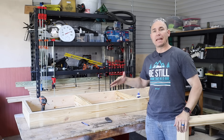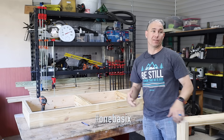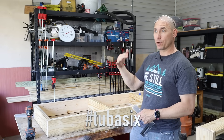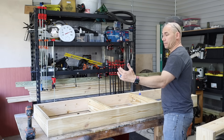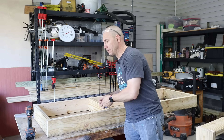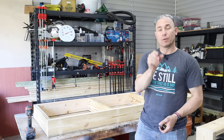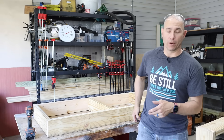So we've got both frames built. Now we're going to put some decking on there. I'm just going to use one by sixes because they're lighter weight and they're a little less expensive than a two by six right now — trying to keep this as low cost as possible. I'm going to cut four one by sixes to the length of this frame, which is 77 inches. Cut four of those and we'll put a gap in between each one, spaced equally so that water can drain out and it's not holding water.